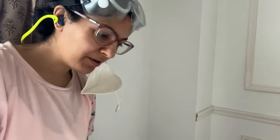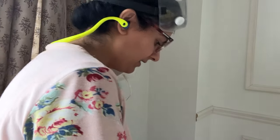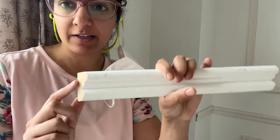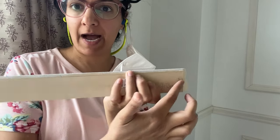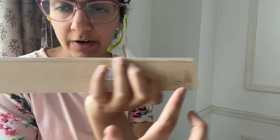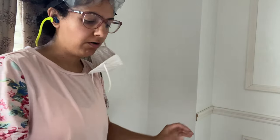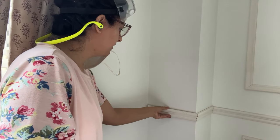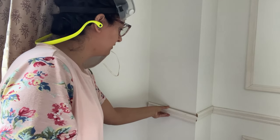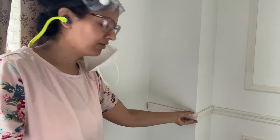Some of these cuts are going to take more than one or two tries and that's just the way it goes — but watch how good this cut is. It's quite a complicated cut: you can see there's an angle on both sides, so when you measure it you actually have to measure back-to-back from corner to corner, because that's the distance of the actual wall. And it's perfect — it's going to be beautiful.